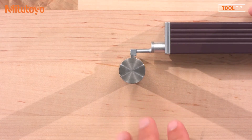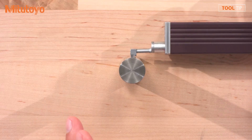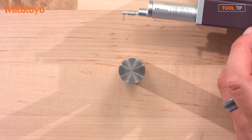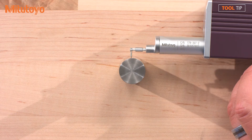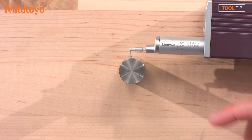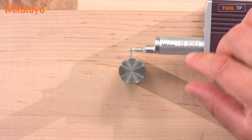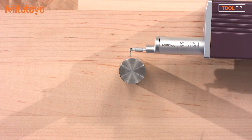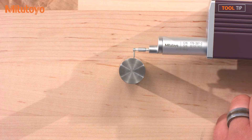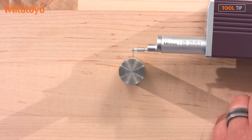Now if I were to take a measurement with the skidded unit in that scenario, I could probably spend some time with the setup and get a number that shows up on my amplifier, but that doesn't mean the number is a good measurement I can trust. So in an application like this, a skidless system would be better. By not having a skid, I can actually bring the stylus in contact with the surface and get a very good measurement. You're going to be able to trust these numbers. As long as I stay within the stroke of the detector — and depending on the unit, that will vary how much actual stylus travel you have — I can measure radially across the part with no issue.